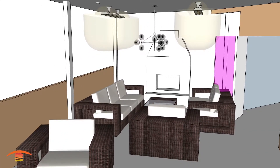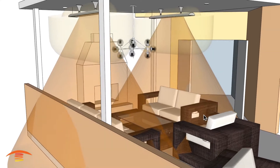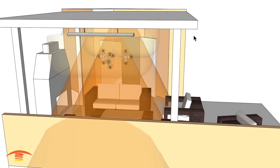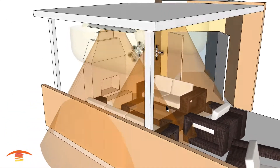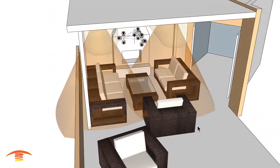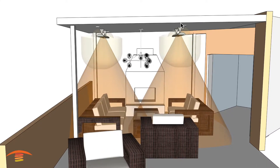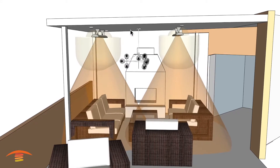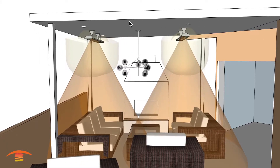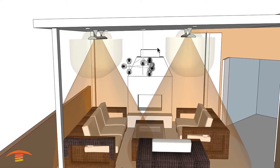The heat footprint is going to be an infrared light wave. You can see we're getting fairly good coverage — we're missing some of the seating out here and we're not covering all the way to the edge of the covered section. However, I think this might just be adequate for this application, because I don't know that they actually want to heat out here further. If they did want to heat this further, they'd need to put a heater over here, and it cannot be placed on a slope from left to right — because as you heat up the elements they start to sag downhill, and as they cool they contract and start falling downhill. It needs to be level at all times.